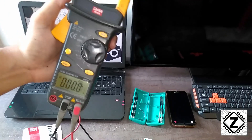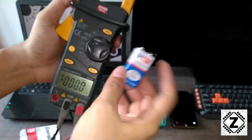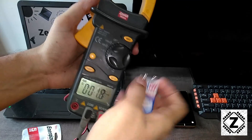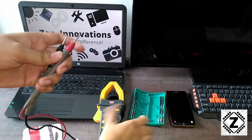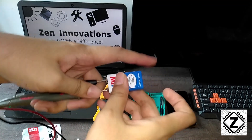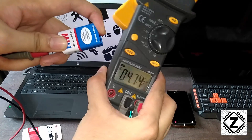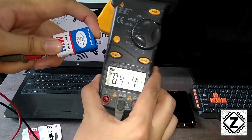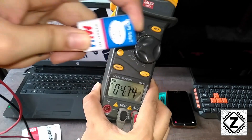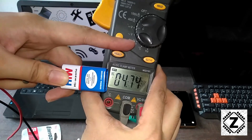Before we end, let's check what charge voltage was remaining in the old blue-and-white battery. Let me put the multimeter in a DC voltage range and test it. The old battery was below 5 volts — at 4.7 volts. That explains why the blue-and-white battery was causing accuracy problems for this clamp meter.